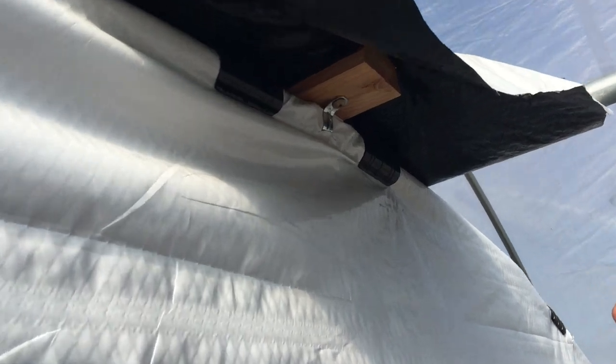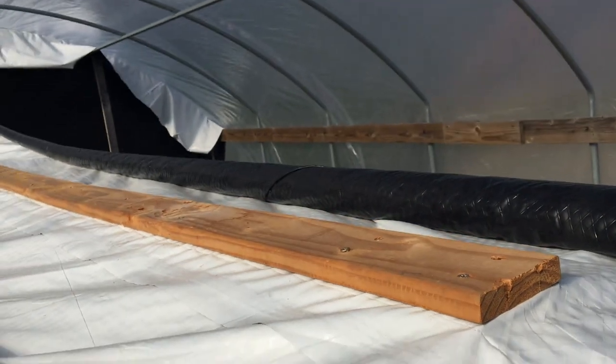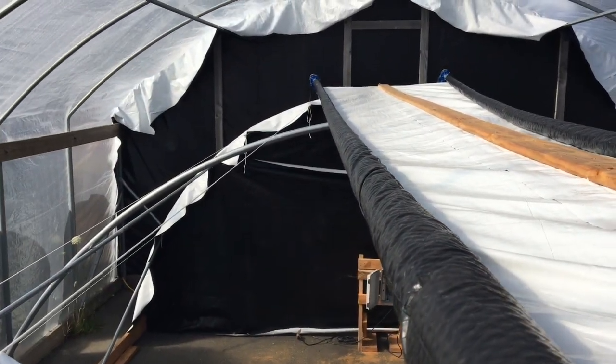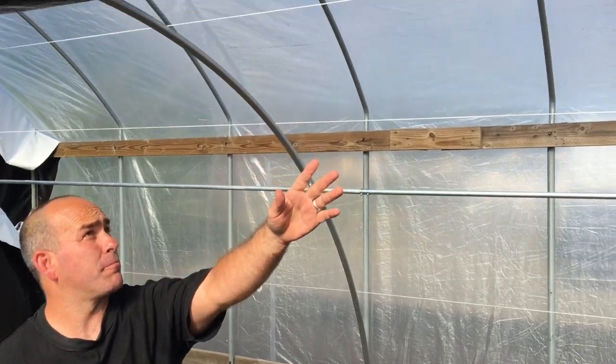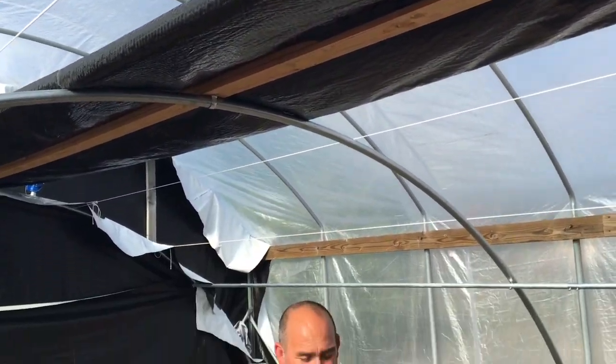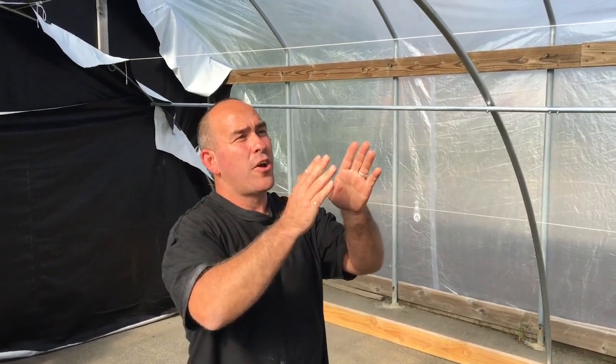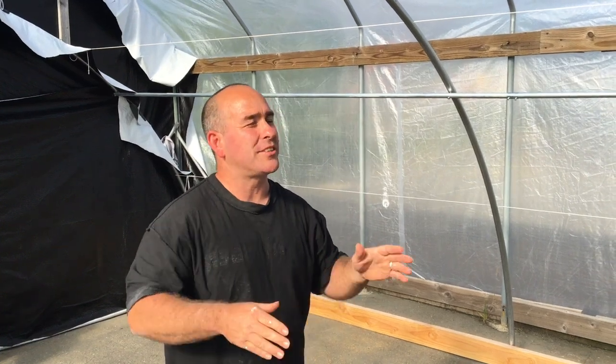If you look at this sandwich here, you'll see that it's actually two boards and then on top is another board — three boards total, all one-by-four. When you put your plastic up and put your stabilizing board on, you want it dead center both lengthwise and widthwise. Measure two or three times and get it as perfect as possible, because every error is going to be magnified and you'll have to do a lot more work undoing what you did.